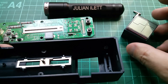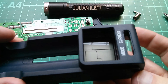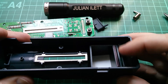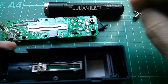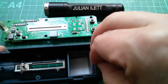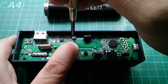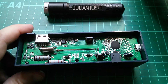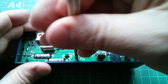Now the question is can I get this back together and get the LCD aligned with the pads on the PCB so that it all works? More things have fallen out. I think that goes in there — yeah, that seems roughly right. I'll need to give it a brush to make sure there are no contaminants on the zebra strip. The button has a little bevel edge, so that has to go that way around. Right, I've refitted the spring on the slide mechanism, and now there's nothing much holding the front down because it only presses against the zebra strip — it's just a bit of springiness in the PCB holding it.